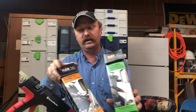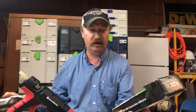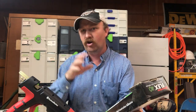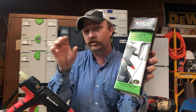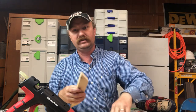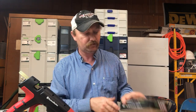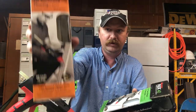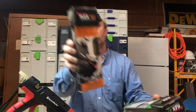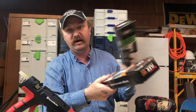They call it Flex 40 and Flex 180. I'm not sure if there are others but these are the two that I use primarily. The Flex 40 is for putting tack strips on concrete, or anything that you'd need to glue to concrete. The issue — or rather the feature — is it has 40 seconds of open time, so you can still position your stuff. After you stick things together, you'll have up to 40 seconds to maneuver the joint to get exactly what you're looking for. If you buy the Flex 180, you'll have 180 seconds of open time.